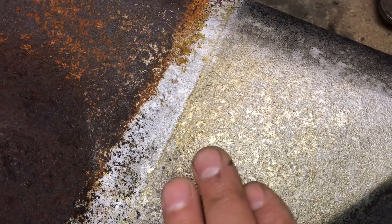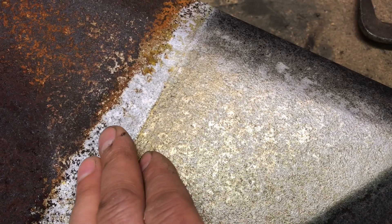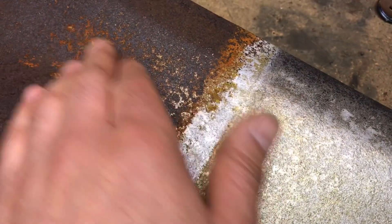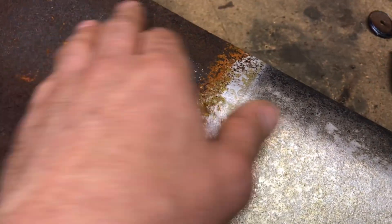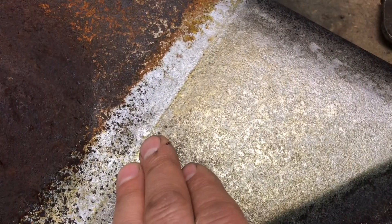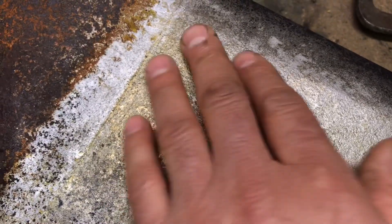What's interesting is I did some work on this area and it was nice and shiny, but when I put it back in and pulled it out again, you can see this line here — that was the water line. Everything that was under the water has flash rusted, but the part above the water didn't, at least in that area. I may have needed to neutralize it with some baking soda or something. The part above the water — three hours later when it came out it was nice and shiny, but when I dried it off it did this flash rusting thing, which is kind of weird.